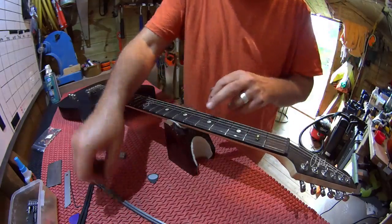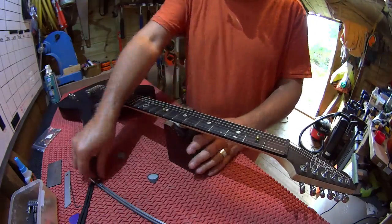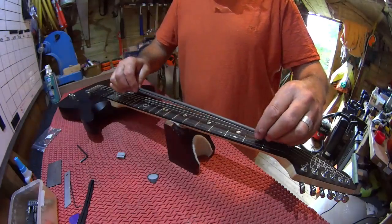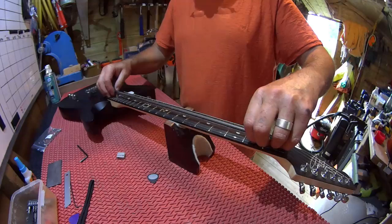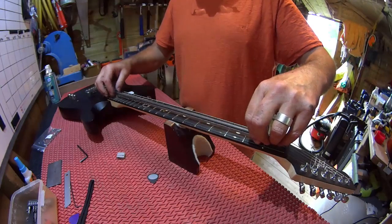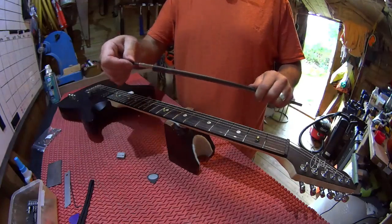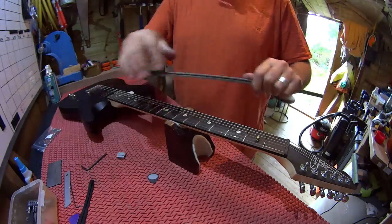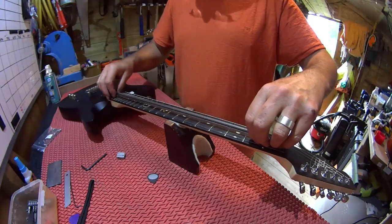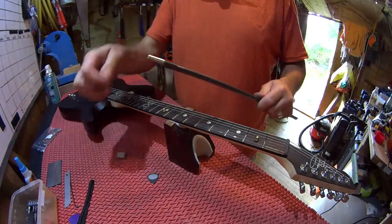And we've got obviously the grooves pretty much gone. There's still a hint of them, but they will go in the polishing process now. But let's say it's a judgment call. If you stop too early, you won't get rid of them, so they'll still be there at the end, albeit less pronounced than they were in the first place. Now this is flattening out a little bit as we go down here, so I'm going to take off a tiny bit of the curve on the rod, and that's why once I get going I recalibrate each one of these strips.